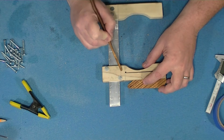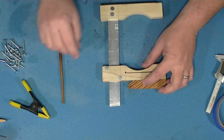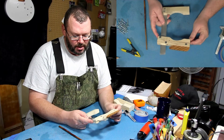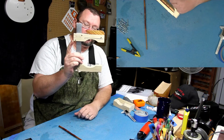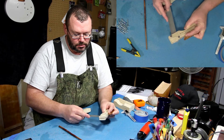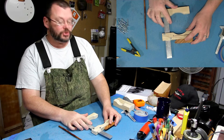Pay attention to how close you get these two nails — you want it to be just a little bit loose, but not sloppy. I have a noticeable gap here, and the problem is when you go to clamp it down it sits at an angle instead of sitting straight across. With the right amount of room when you cut the slice in here, you'll be able to move it in and then straighten it up. So just don't make it really sloppy.